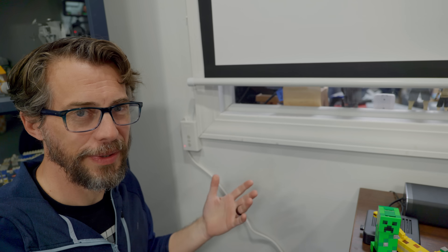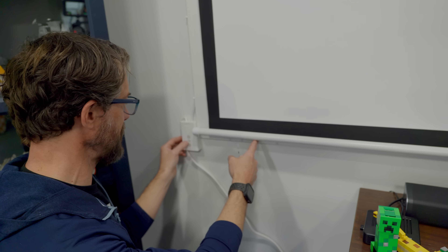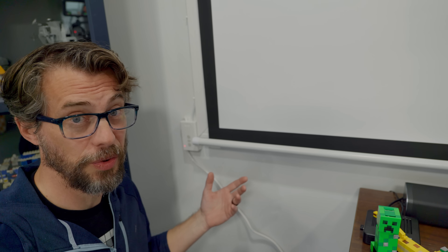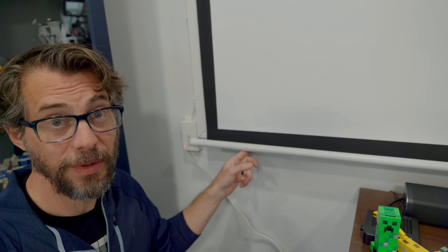If we're thinking about using this as a single device: if we turn it on, it will make the screen go down; if we turn it off, the screen will go up. We can set the brightness between 0 and 100 to tell us how far down to go, if we even need that. I think we just need a physical button that when the screen hits it, it stops — a physical limit switch to stop the screen when it gets down far enough.